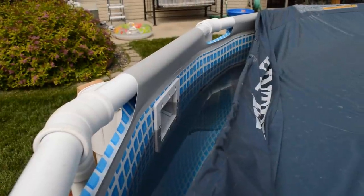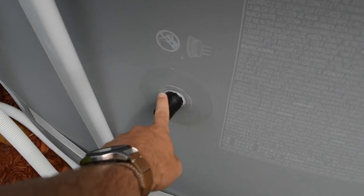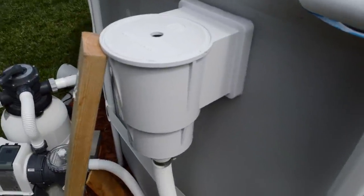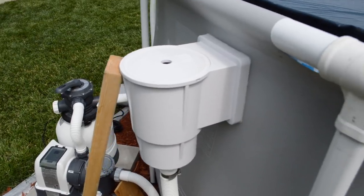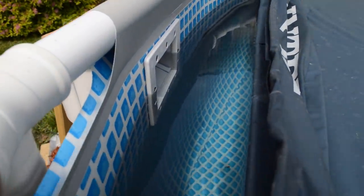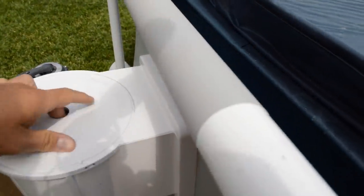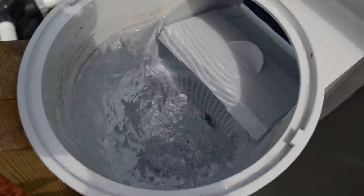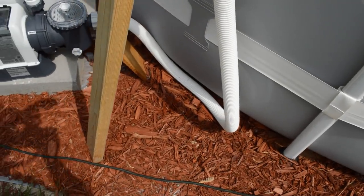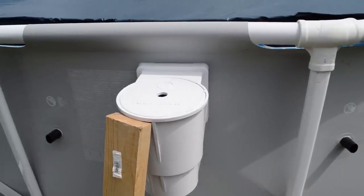If you're going to get the sand pump, you definitely need to upgrade your cleaning ability within the pool as well — just letting the pump pull through the outlets and filter and spit back out didn't do the trick. So I added a Hayward skimmer. The skimmer requires you to cut a hole in the side of the pool, which can be very unnerving, but it does an amazing job of pulling things in off the top of the water. Any leaves or big bugs get caught in the basket, and then it runs down through the tubing into your sand filter. There are several instructional videos on how to do this — it's actually very simple.